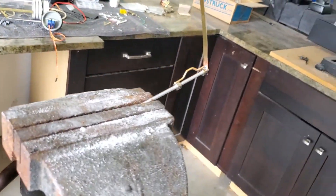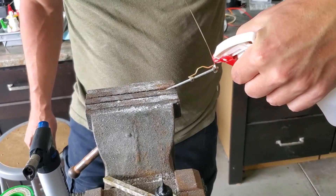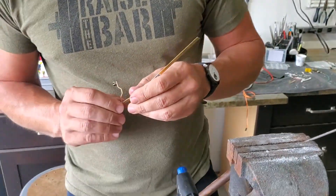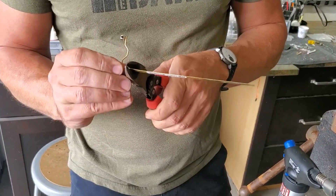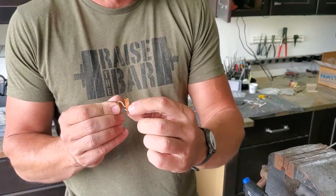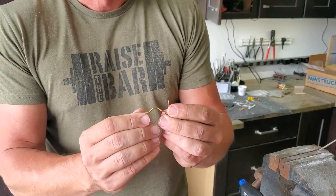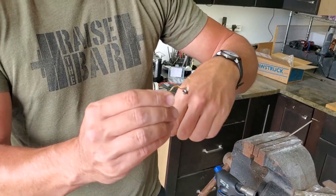Let's apply a little bit of silver solder. That solder flowed all the way around the wheel collar and to that connecting rod. Cool it down a little bit — and again, it did not fuse to that piece of aluminum. So now we've got an arm. I'm going to grab my cutoff side-cutters and trim it to about half an inch. Then all we need to do is drill some 1/16-inch holes, round that off, and probably bend it in so that the curvature of the hull allows it to actuate. Now we've got a fully built yoke for our rear control surfaces.